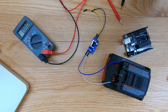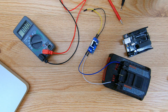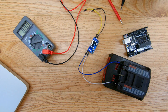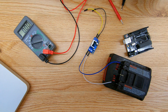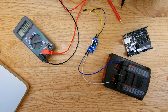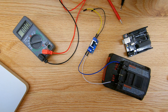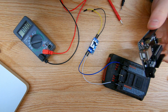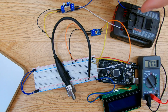According to the data sheet, this voltage regulator accepts an input voltage from 4.2 volts to 40 volts, with an adjustable output voltage range of 1.2 volts to 37 volts. Looking at the amperage ratings, it has a current output of 1.5 amps. So I wouldn't use this to power anything too power-hungry directly, but for just powering an Arduino, it should be fine unless you're running something like a fan through it.